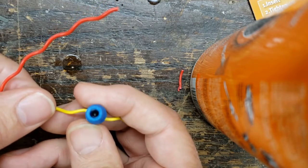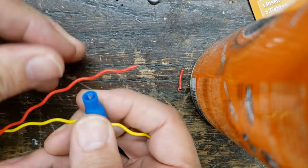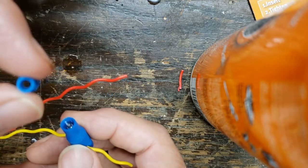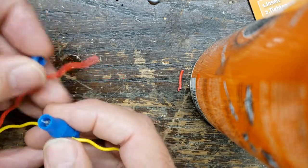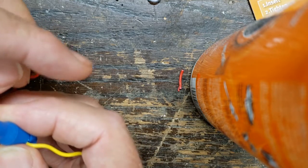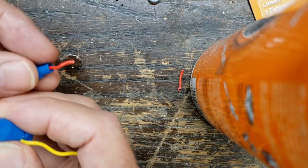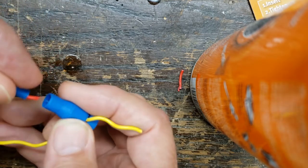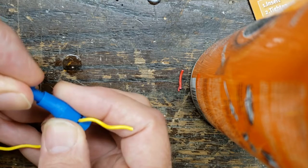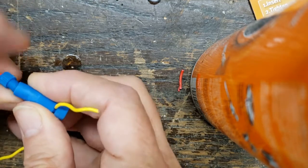The rest of it is a Positap twist end. This actually comes off and there's a metal connection in there, and this part is hollow. So you take whatever wire you're going to connect, strip the end off a little bit, put the sleeve on here, and the wire with the stripped end goes in there.